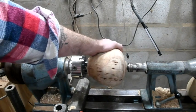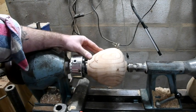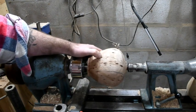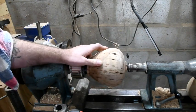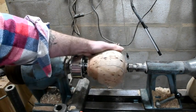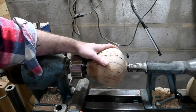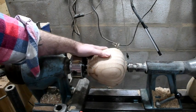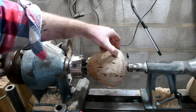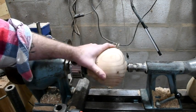She wanted some gnarly wood with a bit of character in it, so I've got some resin already in here. I started to fill it as a big block. It didn't go in as well. I don't have a vacuum chamber or anything fancy like that, so I will get it down to the final form or close enough to it, and then sand it up a little bit roughly just to make sure it's all looking good. Then I'll come back through with some more colored epoxy and fill all the cracks and all these voids and bird's eyes, and just get it all sealed up nice.